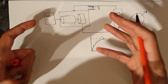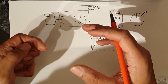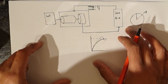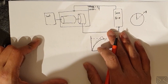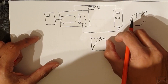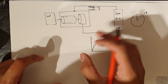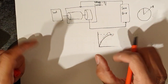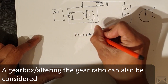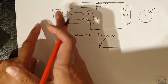With a Chinese servo drive where you don't have access to tune the gain settings very well, that becomes a problem because you can't really understand the dynamic response. To understand it you really need to look at what the encoder is doing, which is possible but more involved. So we need to consider some key factors when sizing them up — two rough ways are looking at the inertia ratio and considering the coupling between your motor and the load side.